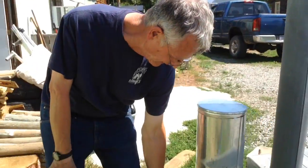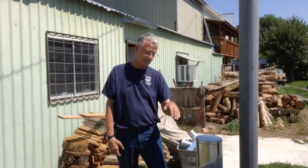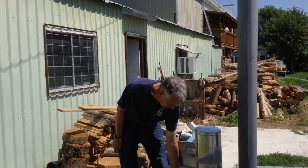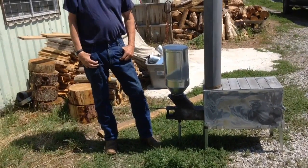It'll take probably 10 to 15 minutes to get up to full burn. The only way to slow it down is by pushing the burner head in — the more you push it in, the more it slows down the pellet flow. Right now I'm going to leave it on full open and wait for the heat.